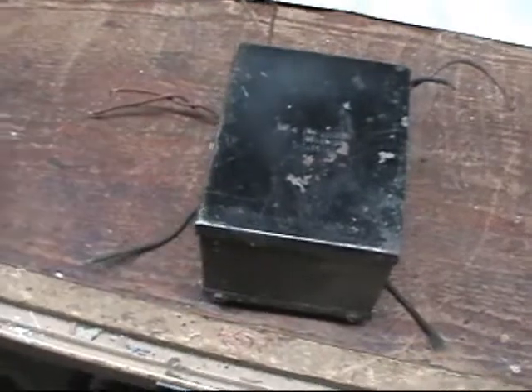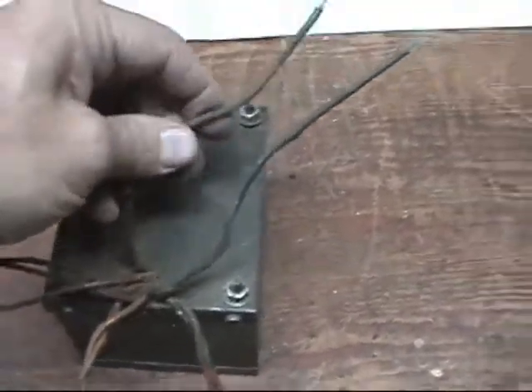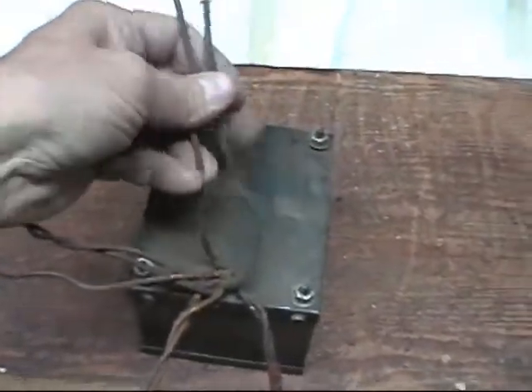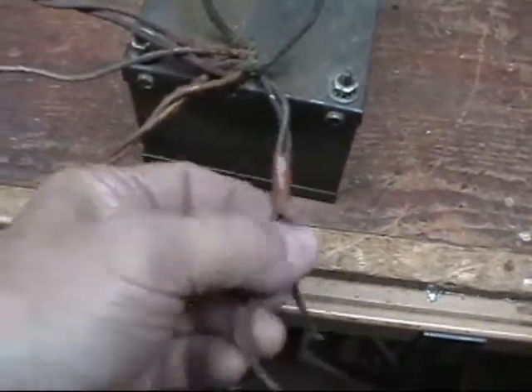Here is a really old power transformer from an early 1930s radio. Something like this is almost impossible to trace out, but you can do it. That's about all the info on it. Generally speaking, these two black wires would be the input or the primary side. The colors are pretty well faded out and not too easy to recognize.